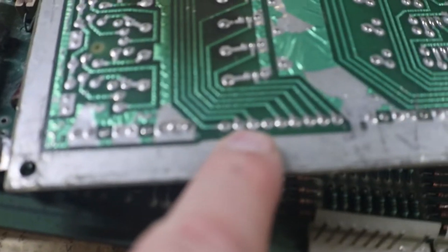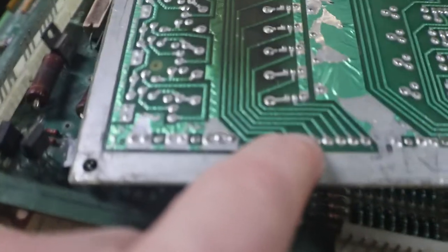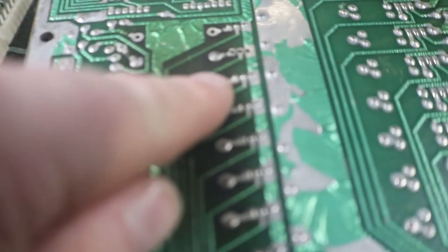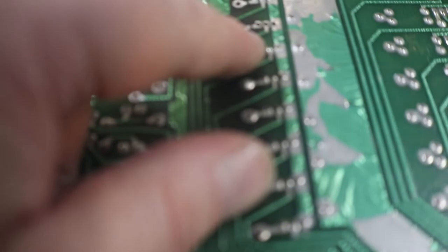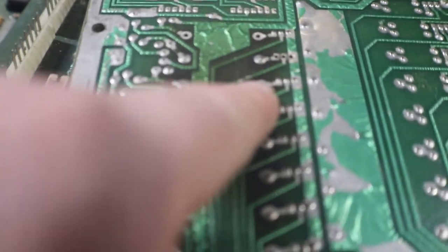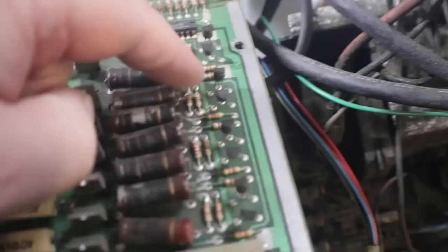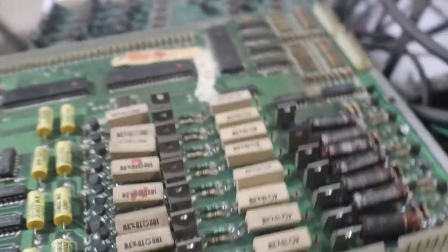You go to your third pin, you follow that up, and it's the third resistor down. One, two, three, and it's here. Check him. And if he's good, then you check your resistor over, make sure it's good, and then the same thing. Everything's in line. Here, you go one, two, that one's missing, three. And then your resistor, one, two, three. Check him, check your little resistors, check your transistors over here. So that's pretty easy. You can follow that right along and check all that stuff.